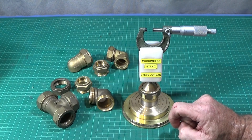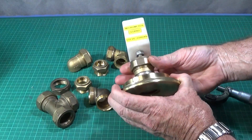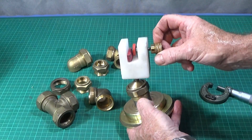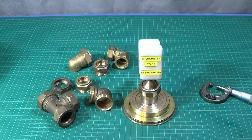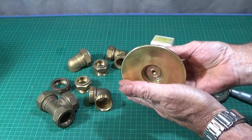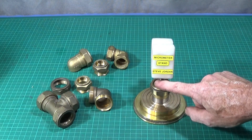Today I want to show you how to make this ball joint part out of plumbing fittings. On a stand like this the ball joint is actually the hardest part to make, especially if you didn't use plumbing fittings. The top section here is a piece of polythene block which I've milled out and put a six millimeter thread in, with a little disc on the front to lock the micrometer in. I used a disc of brass and part of a military shell case to give it some weight.